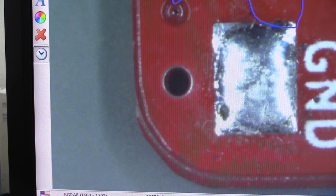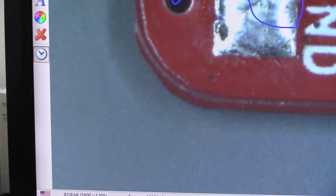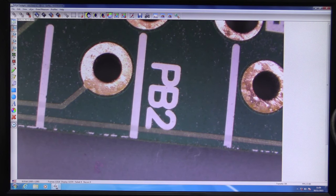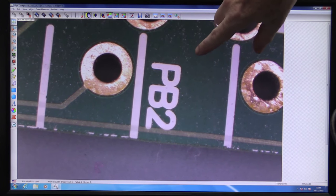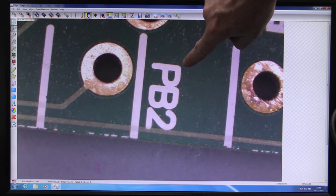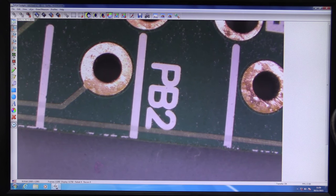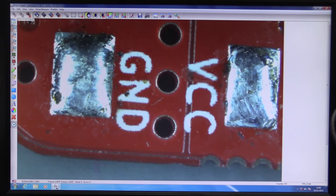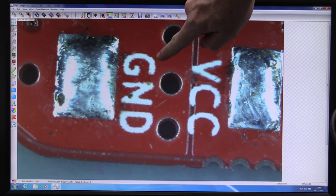So this one's actually not doing too bad. I give that a pass. Now, I switched in the times 8 lens here, so we get double the magnification we did before, and we'll be able to see the difference between what we're looking at now, a board with a photo-imageable overlay on it, photo-imageable silkscreen, for want of a better term, and a dot matrix one. This is the board we're looking at before, and now you can see the individual dots in there.